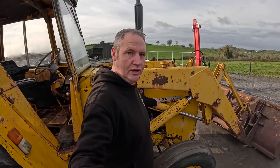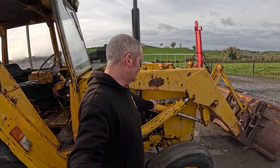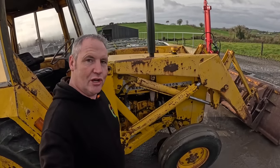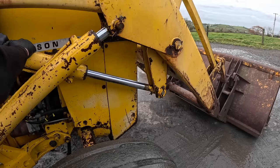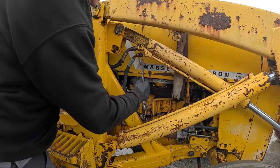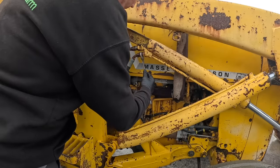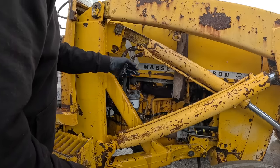Starting at the front is the rams - they're leaking way too much oil. She's pouring oil out of her. Oil is expensive and it's just not practical to have oil spilling everywhere, so anywhere she goes the pan follows. That one there on the bottom is already loose, so that means the pressure's off it, so we can take that one apart first. We're going to leak some oil, it's inevitable. I might actually go down to the shop beside me and get two blank caps, or four blank caps. Let's let her bleed out for a minute.